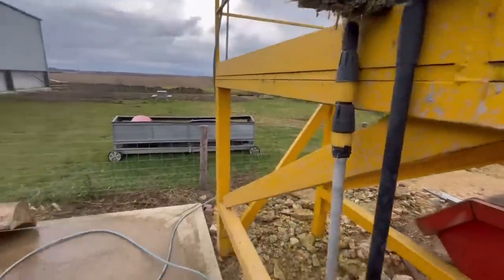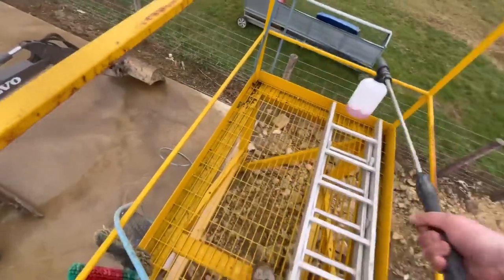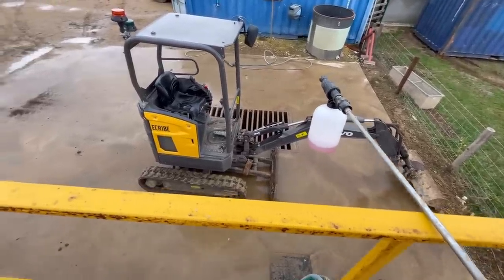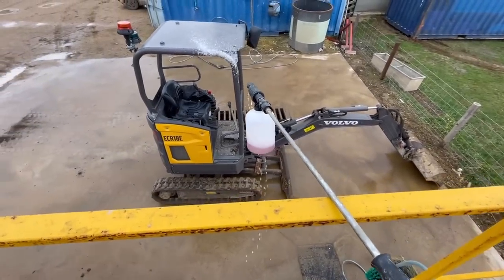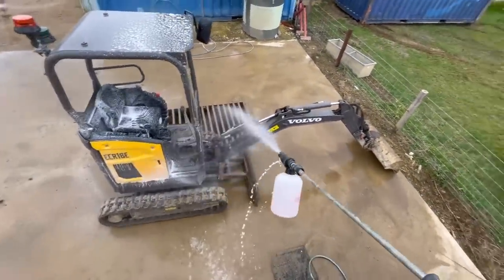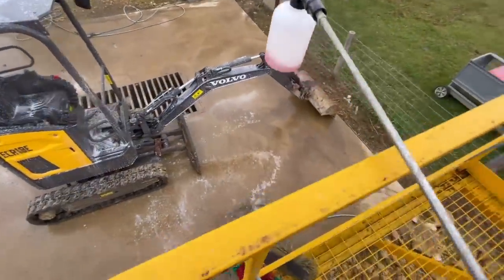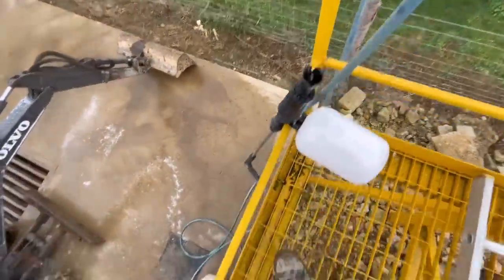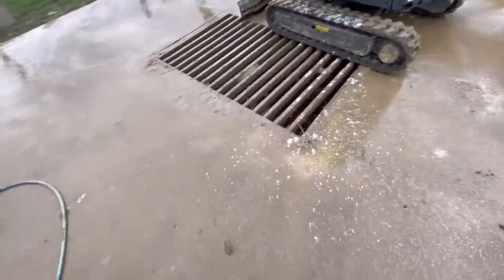I've got my two brushes here for cleaning. There's also chemical that comes out of the other gun, done through the pressure washer. That can take a while to come through and then you have to drain it all out when you're done, whereas this setup is instant. The lance here is just a standard pressure washer one with a bit of a nozzle in the end.